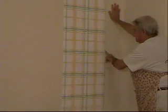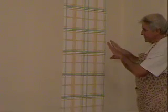When we go to hang it, we're going to concentrate on making a nice seam — what we call a butt seam — where these two pieces of paper butt together. Sometimes you can't get a perfect butt seam because walls are never perfectly flat; they have a lot of roll in them. But you try to butt the seam as best you can. Even if you have to overlap a little bit, it's better to overlap than to have the wall surface showing behind the seam. People make a big thing out of butt seams, thinking wallpaper should be seamless, but walls are not perfectly flat.